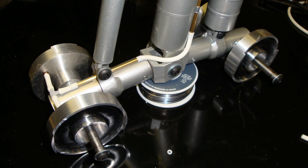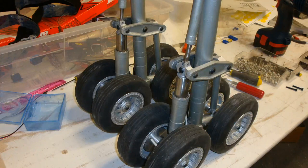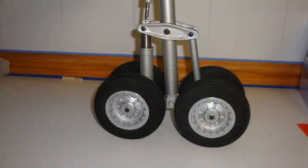Some of the suspension pieces I actually drilled out the inside of the aluminum and took probably 80 percent of the material out, because it was just not needed for a landing gear this size. Here's the air tubing I was doing for the brakes — all got painted up. Here's an example of the finished landing gear with carbon fiber tubes, aluminum drilled out — literally 60 percent of the weight was taken out of these landing gears by the time I was done, including the actuators.